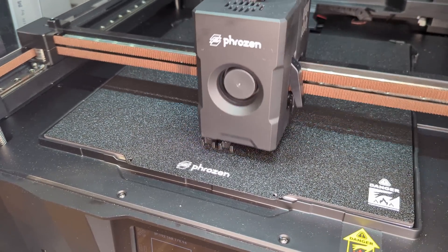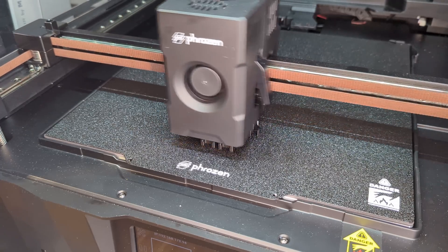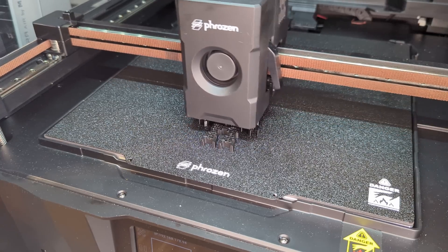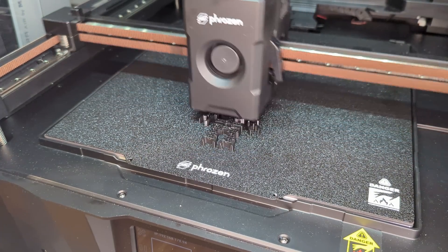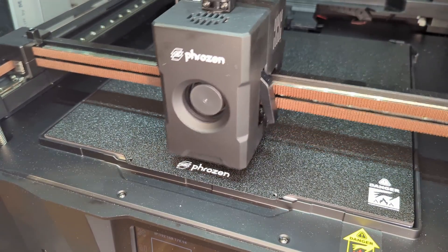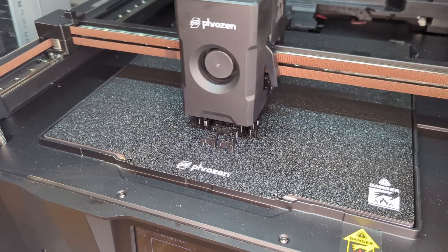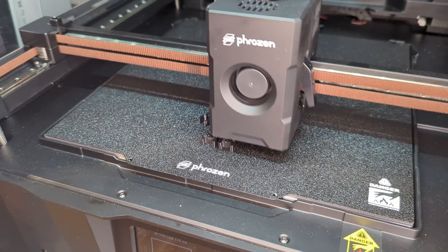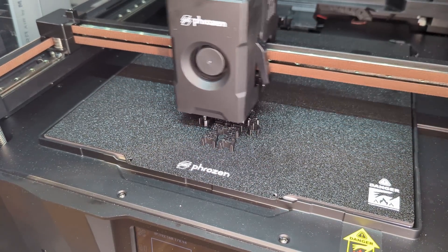There's also a part of me that really likes the printer. If I had to imagine owning the Arco as my first 3D printer, I'd honestly be pretty happy with it — especially because I'm the type of tinkerer who enjoys spending an hour or two tweaking things. Changing the shaper to MZV and swapping in toothed idlers makes this printer my printer, and in that state it can deliver great quality at good speeds. The Arco is not a printer for people who want a press-print-and-forget experience, at least not yet. But for tinkerers, engineers, and makers who love to mod their machines, this thing has crazy potential. Throw a lightweight toolhead on it, change the X-beam, and you've got a machine that could easily compete for a top spot on the Voron leaderboard.